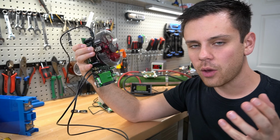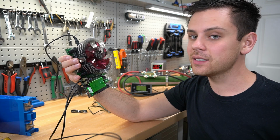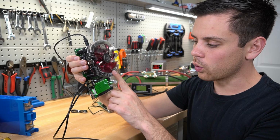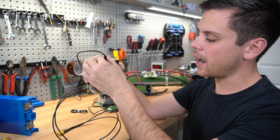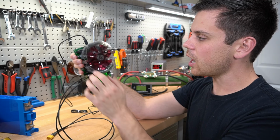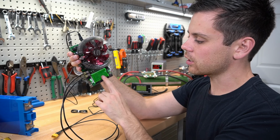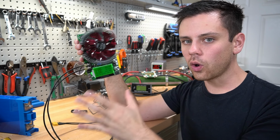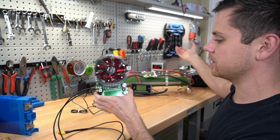If you're trying to do a 1 C rate, or for lithium titanate, a 5 or a 10 C rate, this will not work. What I really like about these is if the battery goes too low or the power supply is cut, it will stop the test. And once you plug it back in, it will start up the test again. So you don't have to worry about your power supply cutting off power to your Hall effect sensor monitor.